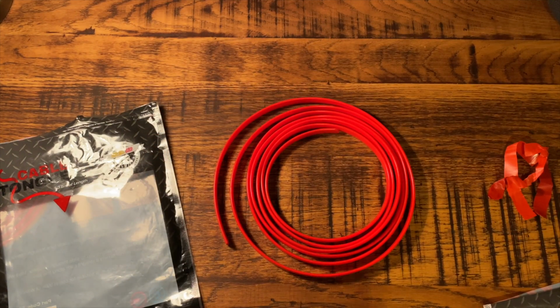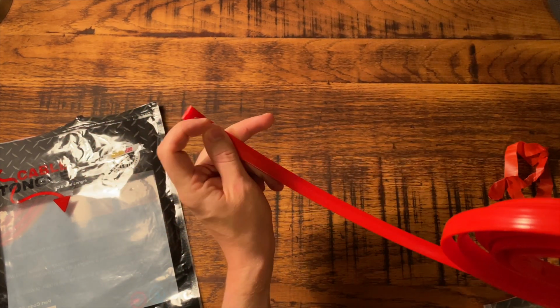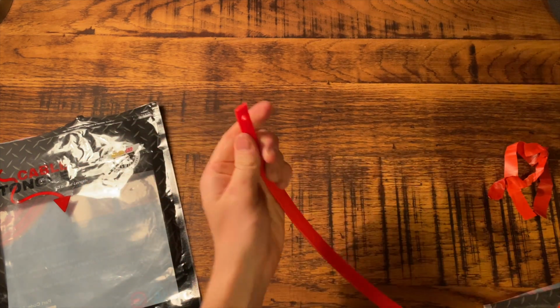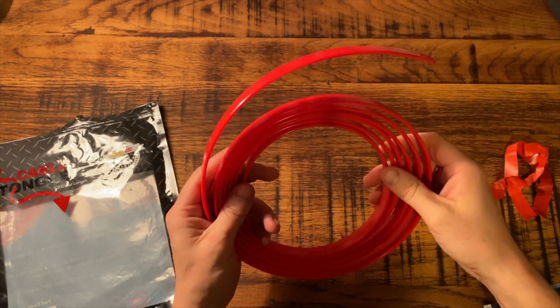And what you can do obviously is strip a cable back and thread the stripped back wires through this, bend them back over, and then tape them, so there's no chance of that coming off. That'll be a nice tight and secure connection to the cable when you pull it in, so that it doesn't pull off.